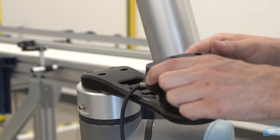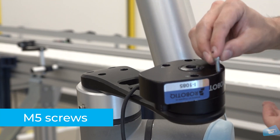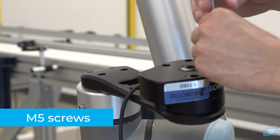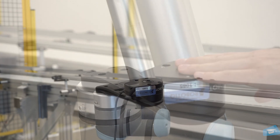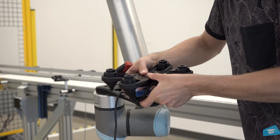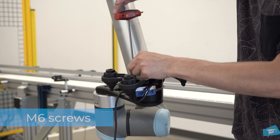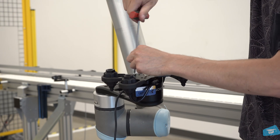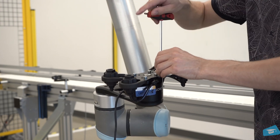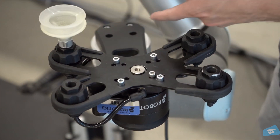Mount the vacuum gripper on the gripper coupling. Align with the dowel pin. Secure the vacuum gripper by inserting M5 screws and tooth lock washers. If the two or four suction cup bracket is needed, align the flat surface on the manifold with the shoulder of the vacuum generator. Secure the manifold by inserting screws and tooth lock washers in a cross pattern to properly compress the O-ring of the generator. Insert each suction cup with an O-ring into an air node. Tighten the cups by hand.